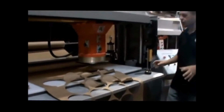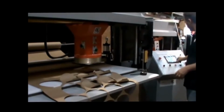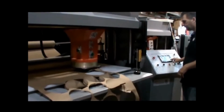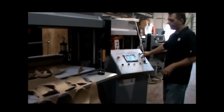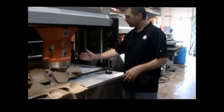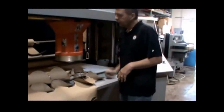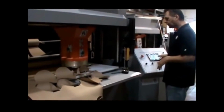Okay, right now I want to demonstrate the light curtain and how it works. So we're going to clear this out. We're telling it that we're starting and going to the left. And right here is how you turn your light curtain on. Okay, to the right is on. You can see that the machine is cutting right now. Okay, so it was on its downstroke, it stopped, came back up, and that's because I broke the plane there. So I hit start again.